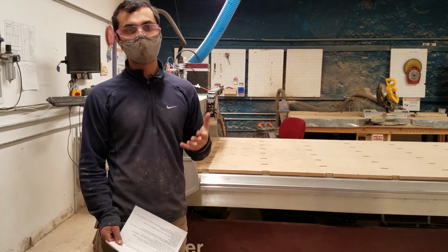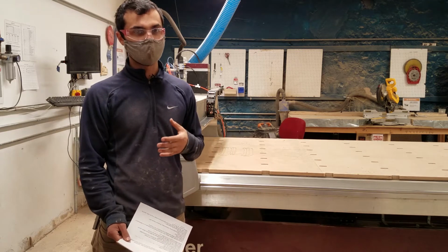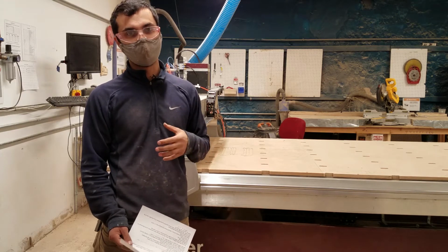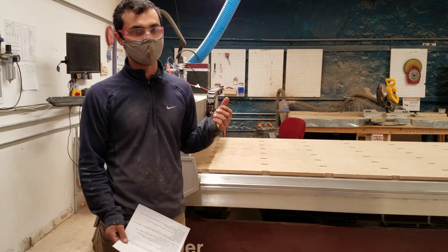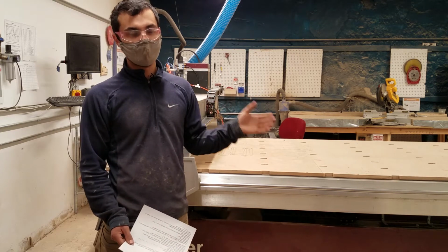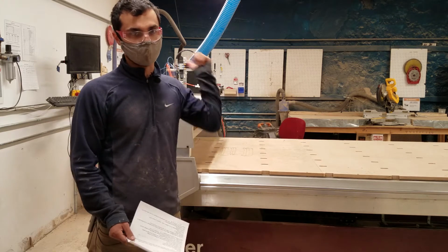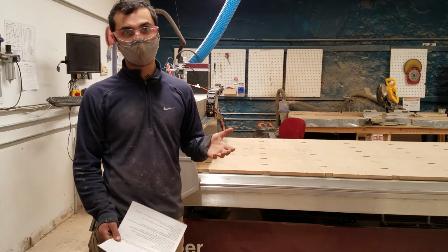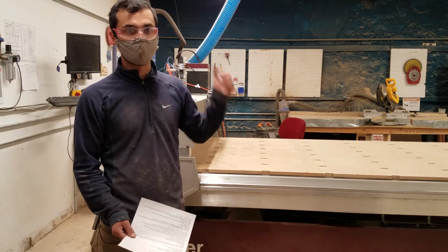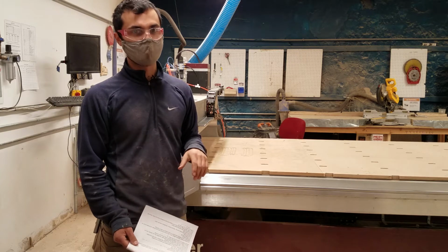You can also download the software from vectric.com and activate it using a software code available once you log into your MakeHaven account and go to the equipment page for the Gerber CNC. Then you can do all the designing on that software on your own computer and then put it on one of the MakeHaven computers to export the actual G-code that the LinuxCNC can run. Additionally, if you're just trying to do some lines or some basic G-code commands that you could type directly into the computer, then you can skip that workflow and just directly use this computer.